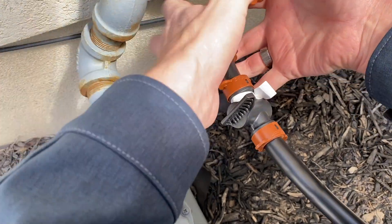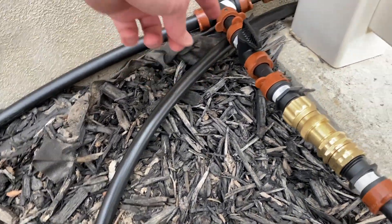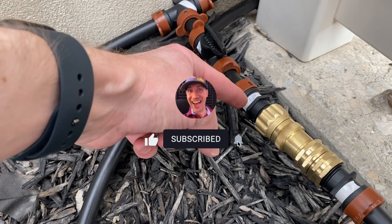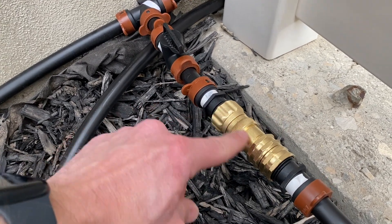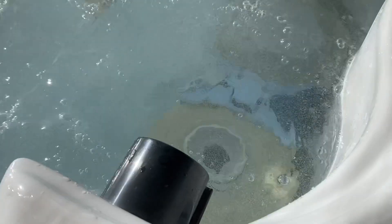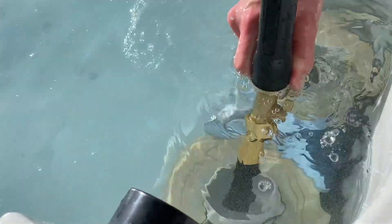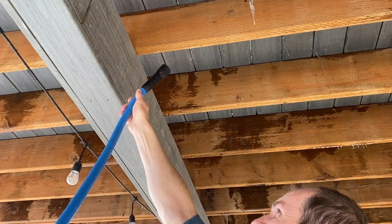One thing you may have noticed is that a pressure reducer is not in my direct head assembly. The reason is I only want the line going to the front section to be at reduced pressure. I want that full pressure to go to the back for another purpose. The downside of doing it this way is you need a bunch of extra parts — going from poly back to a threaded connection, then to a pressure reducer, then to a female-female, back to threaded, and back to poly. What I wanted to do was have some high-pressure water to be able to fill a hot tub. The hot tub is in the backyard, and I don't want super low pressure going to the hot tub — I want high pressure and lots of water. So that's why I decided to divide up the system into both a high-pressure and a low-pressure system.